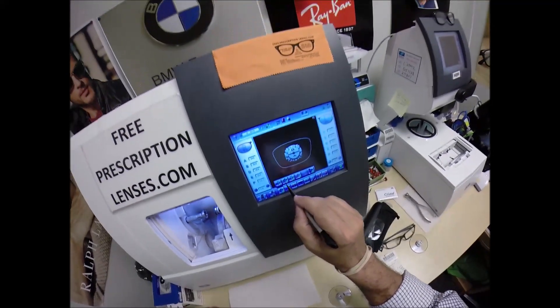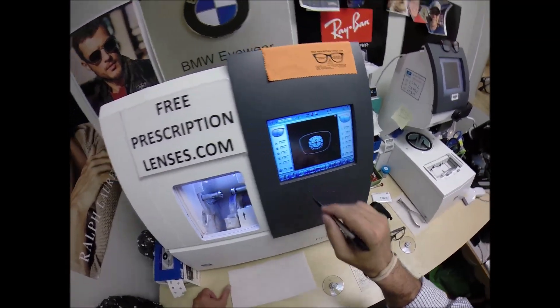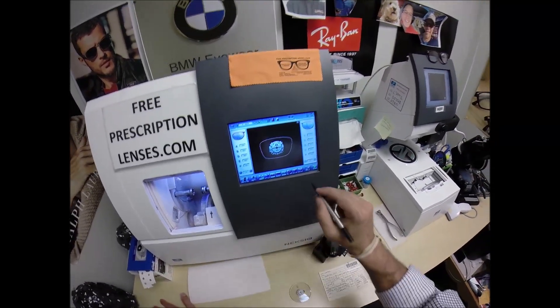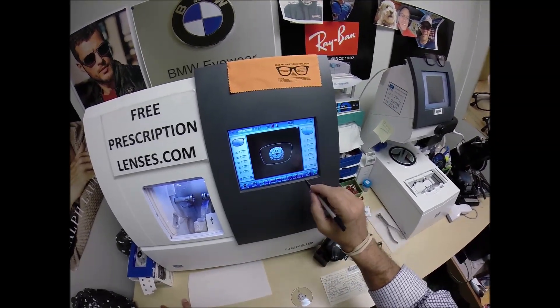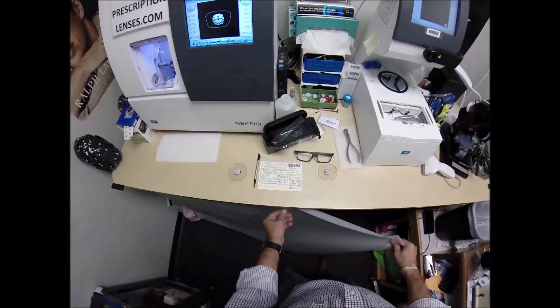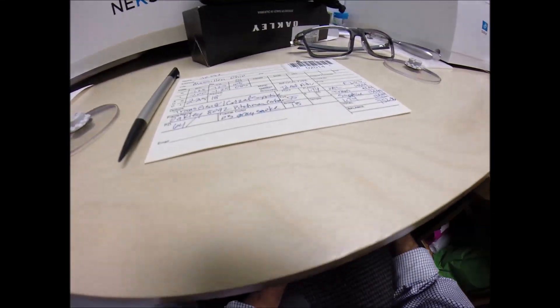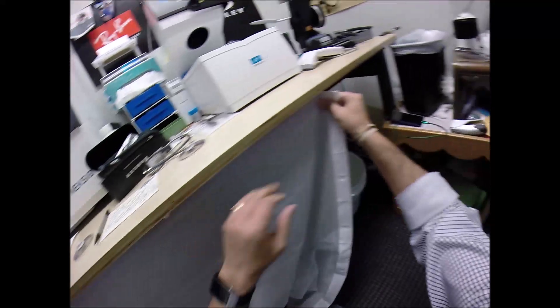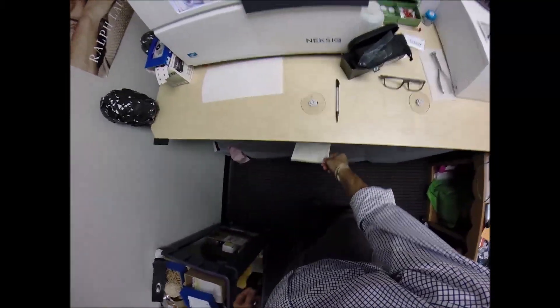I wake up the computer with job number 2001-2014 — I do that so years from now, if you ever want new lenses for this frame, I can mail them right to your home without you needing to mail the frame back. This is set for polycarbonate but we're doing high index 1.74, the thinnest lens allowed by law in this country. I'm not going to polish the edge; I am going to put a safety bevel on the back concave surface. Because these are high index lenses and a bit gummy, I want to empty out the trap — that's the optical sawdust from cutting — so it doesn't clog the filter.